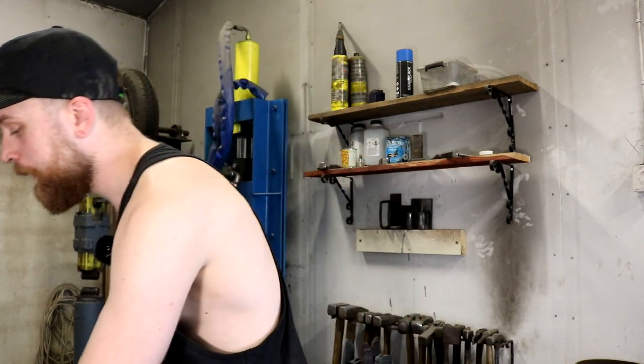So this is the shape that I went for. It's approximately 5 centimeters in length and 2 centimeters in width at the top position, which is how I like my axes, basically. And it tapers down to, I don't know, not even half of that, but maybe 2.5 centimeters in length and 1 centimeter wide, so that you get this hourglass effect when you put it in from both sides. And that's what you need when you are making an axe. You go in both ways. A drift is very good for that, a handheld drift.